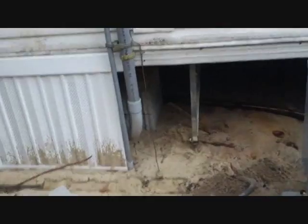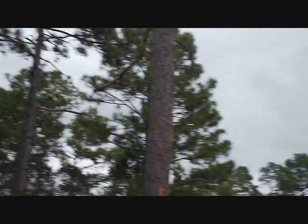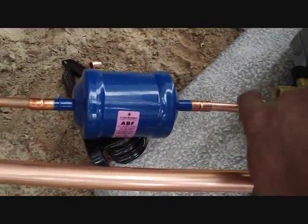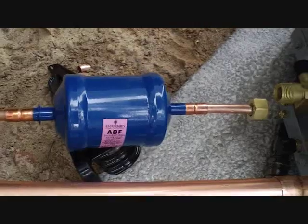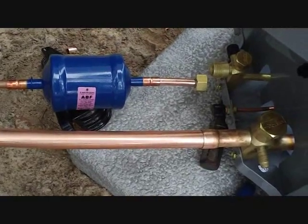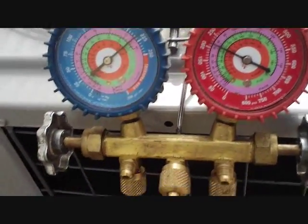The new Heil looks great up there. About to put the line set down underneath the trailer — it only runs about 10 feet and turns up. We've got the brazing all set up, copper lines fitted, little 45s bent in, dryer mounted. You can see the pistons here for the outdoor unit. I loosened that up and I'm going to send nitrogen in through here — it'll pass inside to the indoor evaporator, push back the TXV, run around and go out. That way we can braze up with no deposits and a nice clean line set. We've got about 215 pounds held for about 20 minutes, so I'm pretty happy with that.